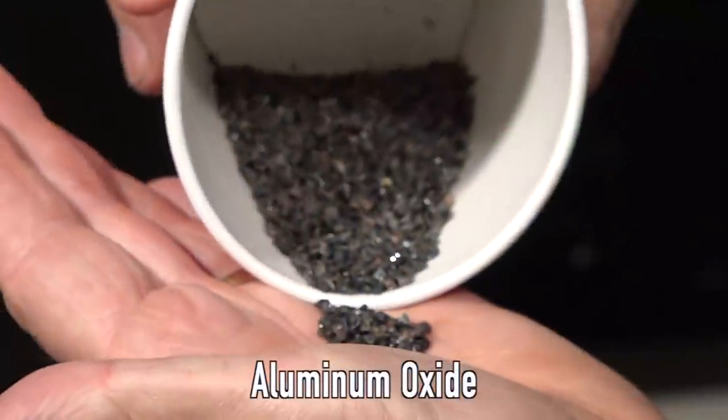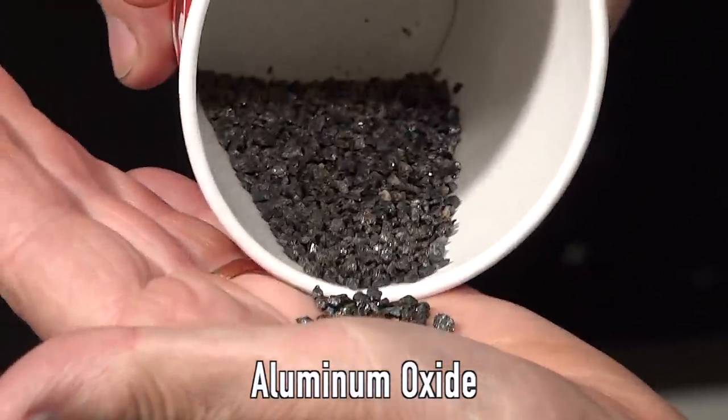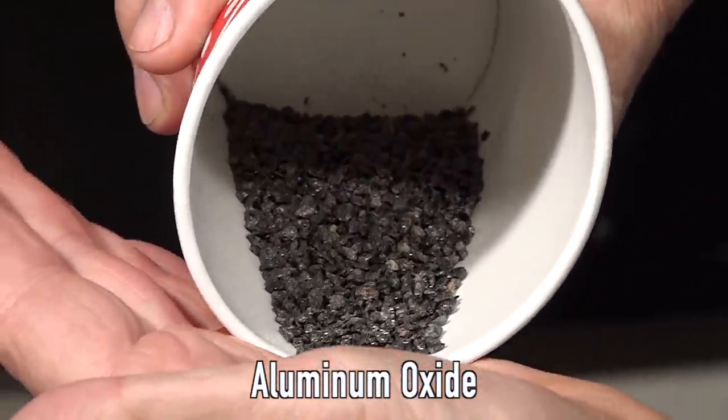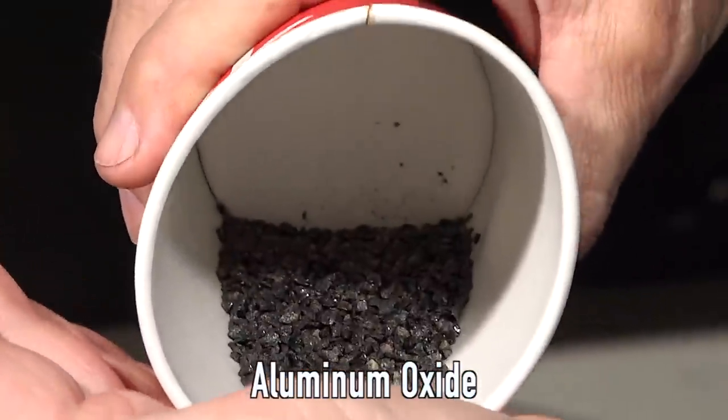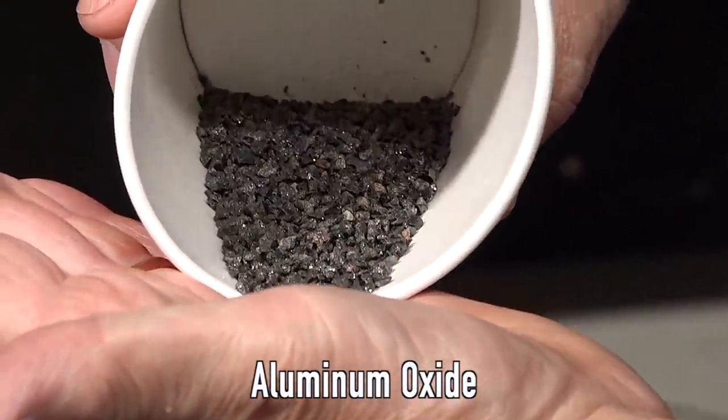Let me explain. First of all, let's talk about tumbling for just a minute. Tumbling, as it's called, and that's the proper term for it, it's actually called tumbling technically. Tumbling of a tank is a very simple process in which you put some gritty material. Usually, aluminum oxide is a very, very hard material, like very coarse sand. And you put a bit of that inside the tank. And you put a little bit of water with that to make it a bit of a slurry. It's sort of like a very crunchy chili.